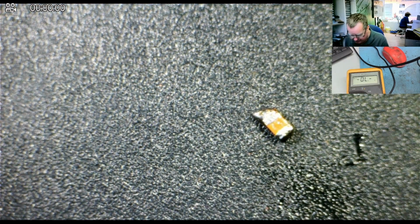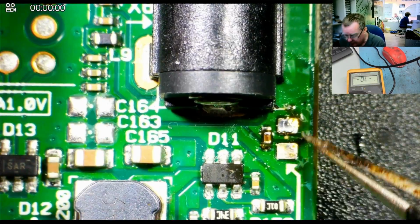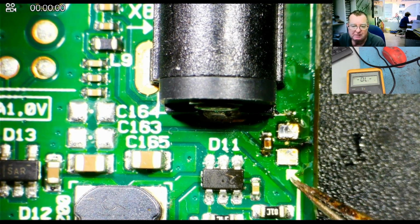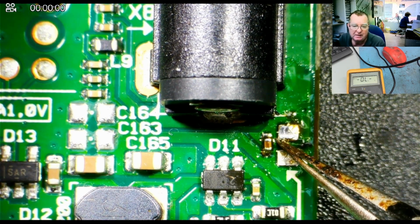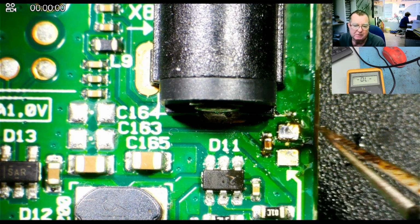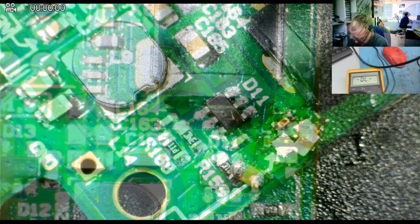It's not critical. It needs to be something that's more than 12 volts. I'll probably put a 10 microfarad 25 volt in there, but to be quite honest, this will work without it. It's just there to give a little bit of extra smoothing or decoupling where the power comes in. Normally this one's around 10 microfarads and this one will be about 100 nanofarads. Those are typical values. If you find something like this, that's what you would replace them with.